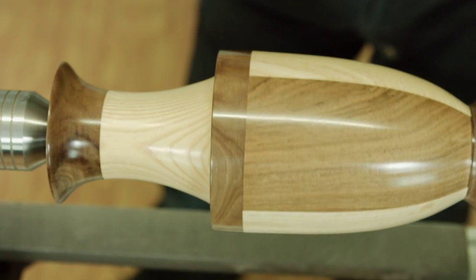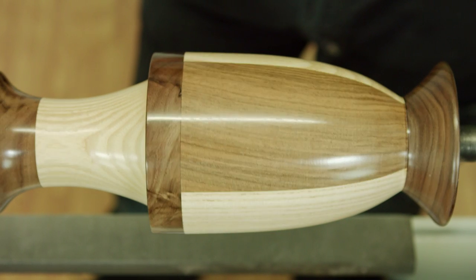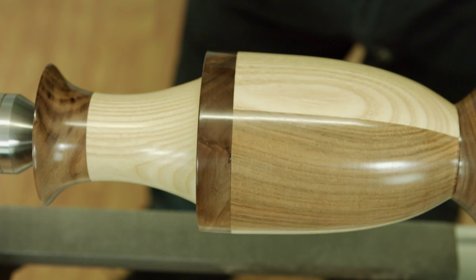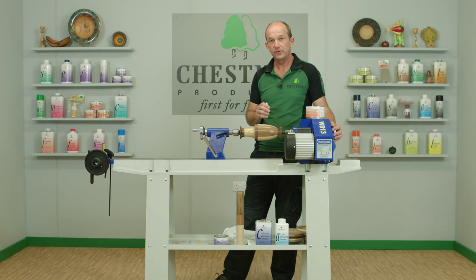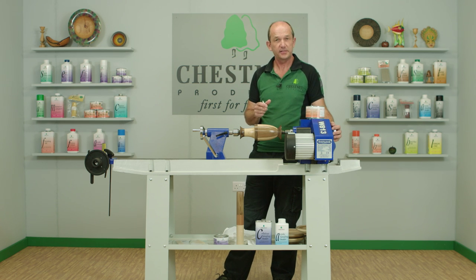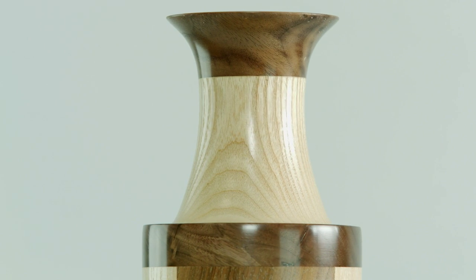You can see the shine we've got on there already. If you want, you can put a second coat of Wood Wax 22 on — you need to leave it about 10 to 15 minutes for the first coat to dry off completely; it's still very slightly tacky where it's warm, so leave it 15 to 20 minutes. Then put a second coat on — don't sand between coats — and you can put a third coat on if you wish, again after another 15 to 20 minutes. I wouldn't recommend going past three coats; it will start to get too soft. If it's a purely decorative item you'll get away with it, but if it gets any handling at all it will start to finger mark very quickly.